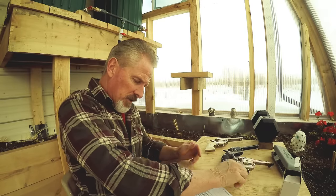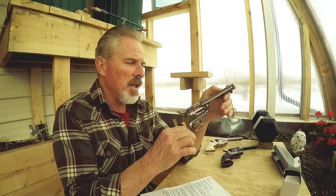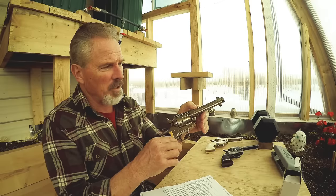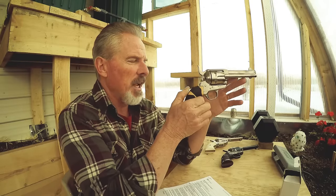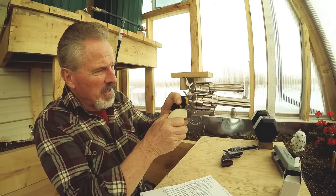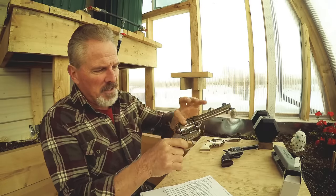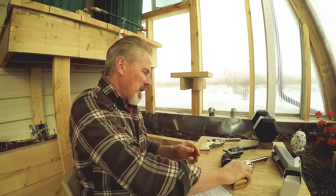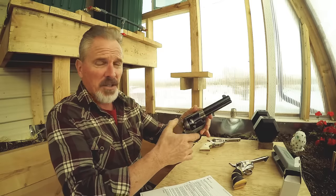This single action army race gun is a Mitchell clone, built by an unknown gunsmith. I found it at a gun store, bought it for $800, and I've run it hard — broken parts on it, put it back together, silver-soldered it here and there. It's a little ugly, but it runs good. The hammer is modified over a stock hammer — that's a fanning hammer. That's not what makes it a race gun; it doesn't make it go faster, it just makes it much easier to hit the hammer. This other gun is a race gun I built with a stock hammer, and it'll shoot just as fast.